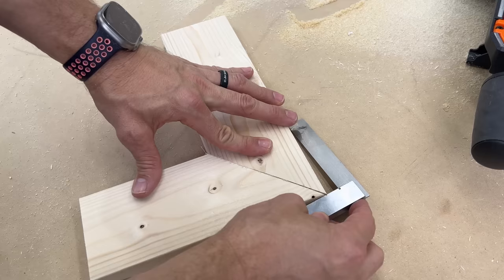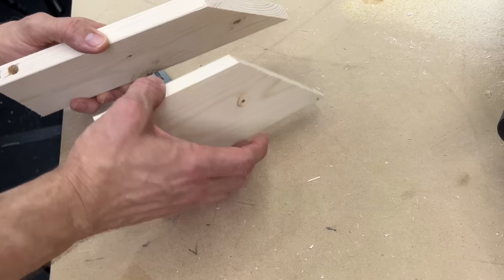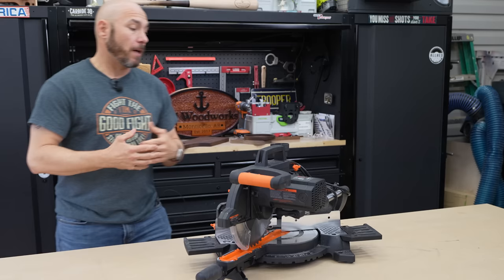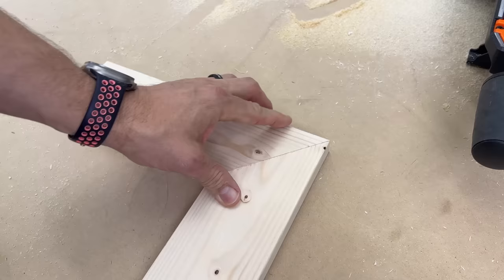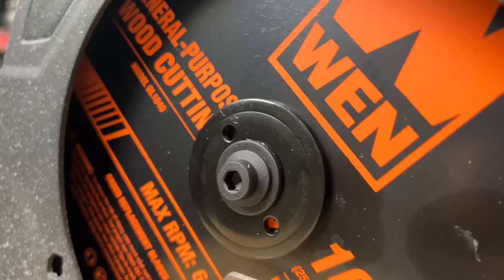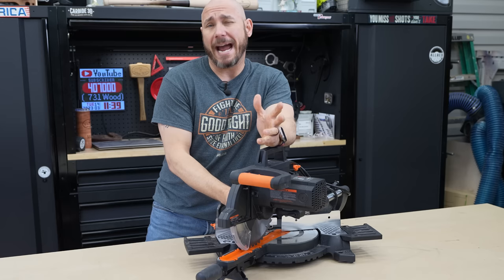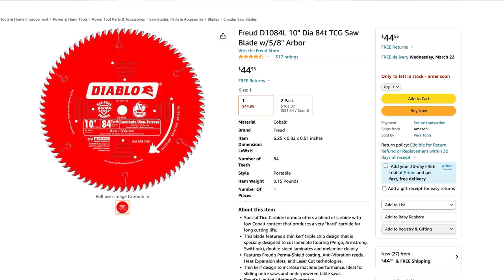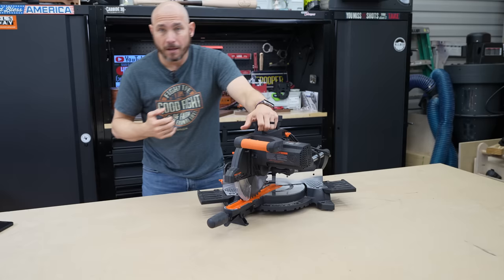It's perfectly square — cutting two 45s, sticking them together, and checking them with a square, both outside and inside measurements were square. The cuts are nice and straight as well — no bowing or bending. For a stock blade, I'm impressed for $200. The blade is actually really good for a stock blade. Most stock blades you get with any saw — even a $3,000 SawStop — they're kind of trashy. This one is pretty good. I think most people would be happier with something like a Diablo blade, the 10-inch, 5/8-inch arbor, which is a pretty standard size. I prefer 80-tooth or up on a miter saw since you're making cross cuts and want a finer cut. I'll put a link to my favorite one in the description.